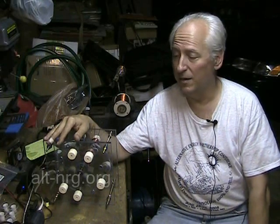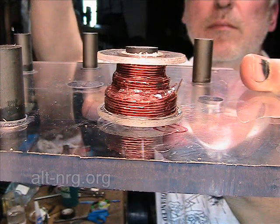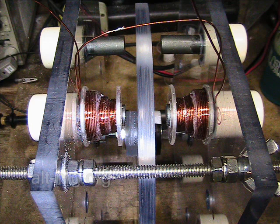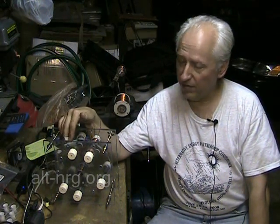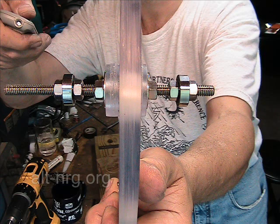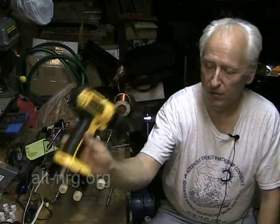This afternoon I've spent a lot of time trying to wind coils, have met with some failure and some success. The coil winding jig that I put together is working out very well. I have completed, yesterday, two scaled down replications of the actual Müller motor coil design. They are a stepped coil design and they are assembled to the ferrite stator cores already in one of the positions. The rotor — I have built up the center of the rotor hub so that the rotor sits perfectly square on the axle shaft now, and it spins perfectly true. I have virtually no measurable wobble whatsoever. I spun this thing up with my DeWalt drill up to about 1400 RPM to get it started.